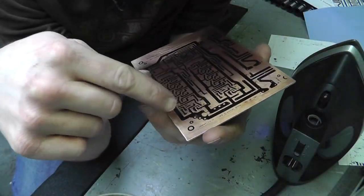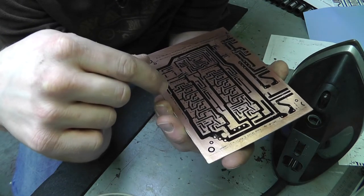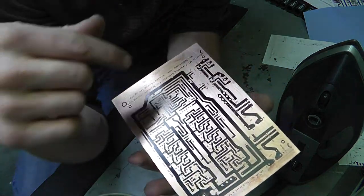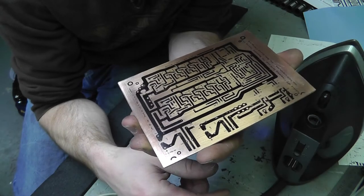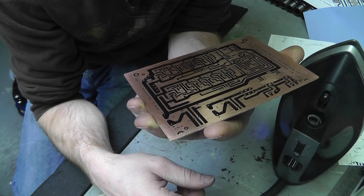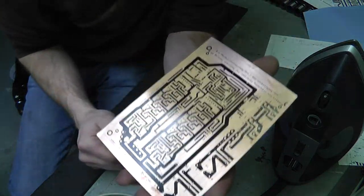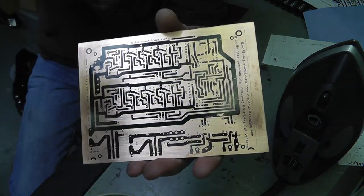Anything that didn't turn out that you're okay with fixing, you can take fingernail polish and mark over it, and then the etchant will not eat that. Now what you need to do is go get some etching solution. I buy mine at Radio Shack. I'll show you the next step another day, since I don't have any. So, see you soon.